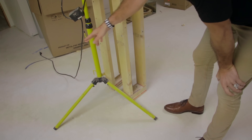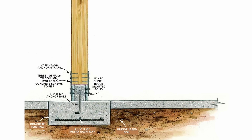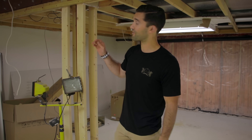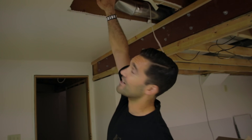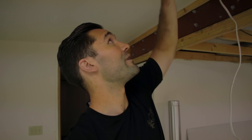These teleposts sit underneath and support the structure. Underneath, you'll find a footing that's supporting the weight of that structure. You can't just put teleposts anywhere — you need to actually pour a foundational support underneath these teleposts. The third telepost is actually hidden inside that wall, so that might happen in your house where you're looking for teleposts and can't find them. Typically, a good home builder will hide those posts next to stairs or in walls so they don't stick out. So we found our beam and we're looking right at it here, and we can see the joist right above.